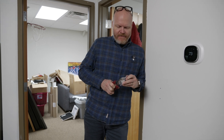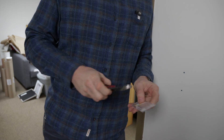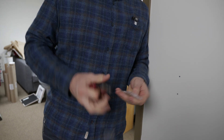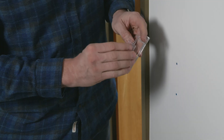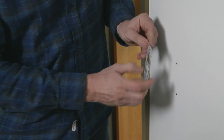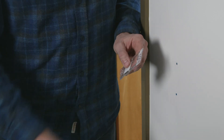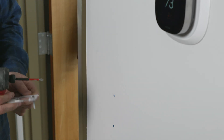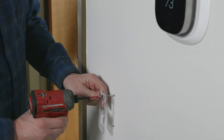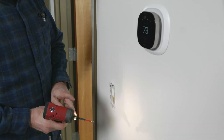You've just got to get this little tab off right here — it just needed more force than I could apply. You take these little edges off and then it's off. The reason you take that off is because if it's sitting flush against the wall it stands it off too far, and it just doesn't look right when you put the cover plate on. So you get rid of that, take your screws, and start screwing it in.